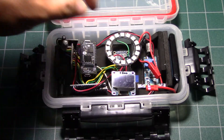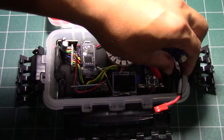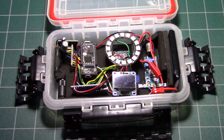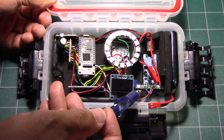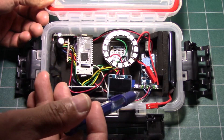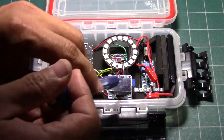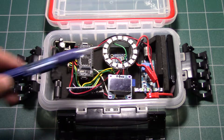It's powered by an RC car or RC toy battery. Because of that, those batteries don't have a LiPo protection circuit. Just for safety, I bought one of these little LiPo protection circuit strips off Amazon. It's connected to a boost converter that boosts up the 3.7V to 5V, and that powers everything.